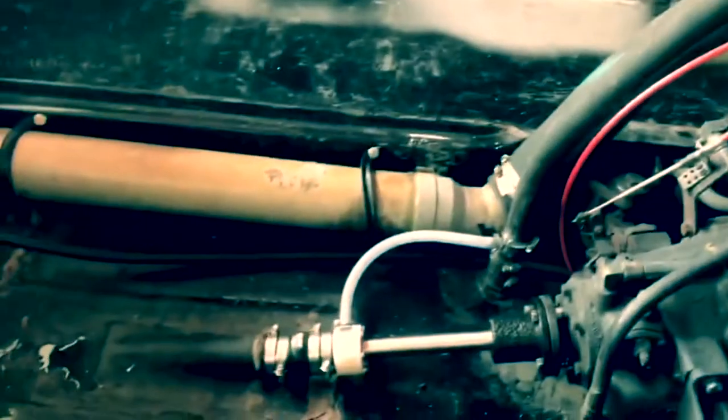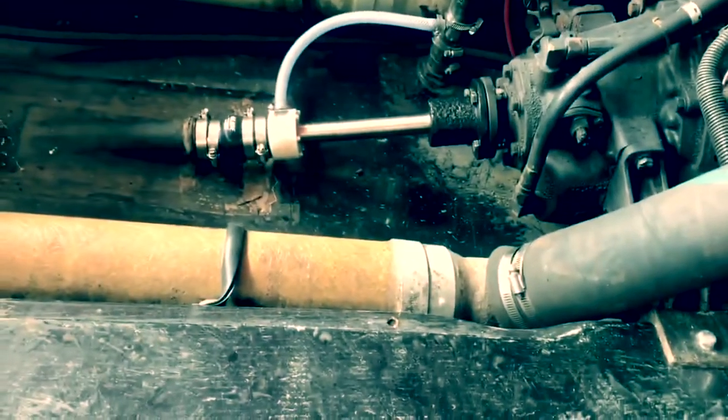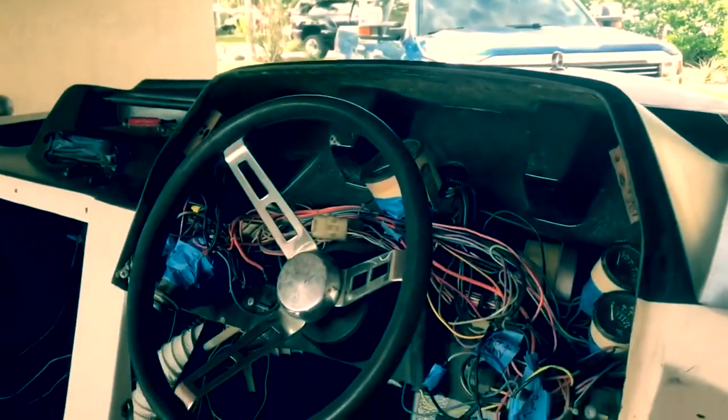All decals were off. We had to do some filling where there were some gouges in the boat. Rub rail is ordered. Had to completely redo the new strut — we put a glide pack housing on, which is the dripless pack housing. Had to redo the coupler as well. Motor's in good shape. All floor is out, all interior is being done right now. Dash came out yesterday — we're getting a new dash to match. They'll have an all-new floor. Windshield is obviously off; we've painted that. That's ready to go back on pretty soon after the paint.